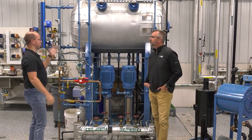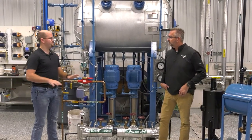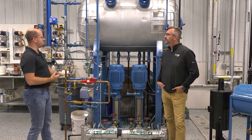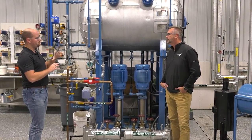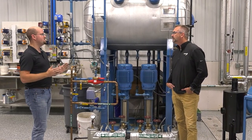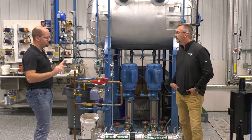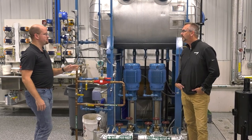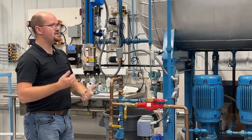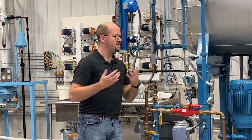We're also using a little bit of the mechanical force of that driving steam to get some of the oxygen out — so we're heating it up and trying to drive as much oxygen out as we can, but with no pressure on the condensate tank; they're completely vented, atmospheric. One thing we see with both of these is that driving up the temperature and driving out that oxygen protects the boiler from oxygen pitting. We don't want oxygen pitting on our steel. Deaerators get a lot more oxygen out of the water, whereas condensate tanks get some out but are not quite as efficient — they're simpler and don't do as good a job.